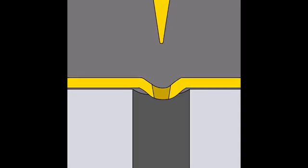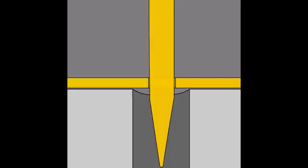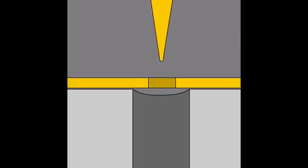And as you can see at this point, the tapered section of the rod was about halfway through, but the hammering had deformed the hole, and although it was wider, it was getting somewhat domed. To correct this, I flipped the mount over and hammered the taper of the rod the rest of the way through from the other side. And by the time I had passed the full tapered section through the hole, the domed section of the brass had been pushed back close to being flat again. And then I basically created the same kind of taper with a 1/2-inch brass rod and repeated the process until the hole was the diameter that I needed.